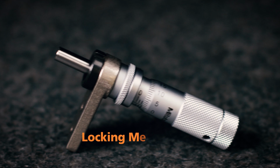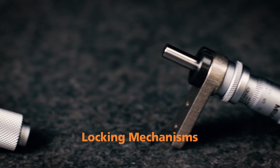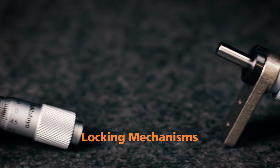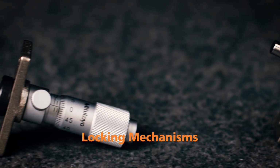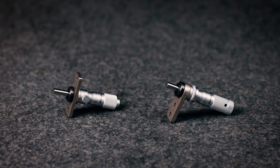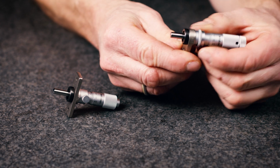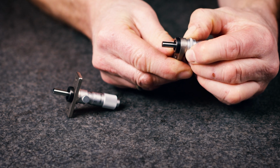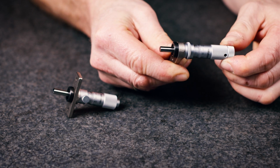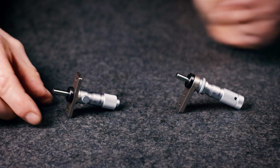If a micrometer head is used as a stop, it is desirable to use a head fitted with a spindle lock, so that the setting will not change even under repeated shock loading. Mitutoyo provides 2 types to choose from: the locking ring type or the locking screw type.